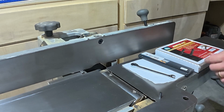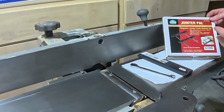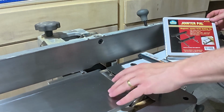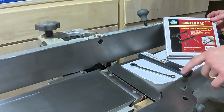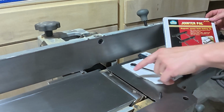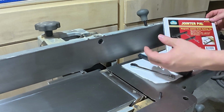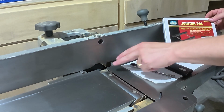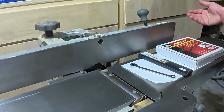So this jointer pal, made by Woodstock, affiliate link will be in the description. It makes aligning this blade with the outfeed table really easy so that you don't have to mess with the outfeed as much. And since this is a straight blade, you really want each side of the blade to be exact. You don't want this side to be higher than that side, otherwise you'll never get a flat board, which is the whole point of a jointer.